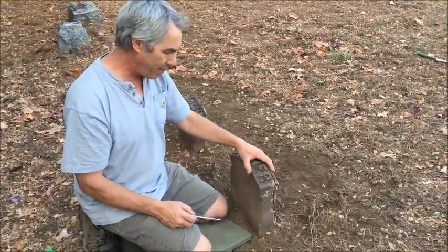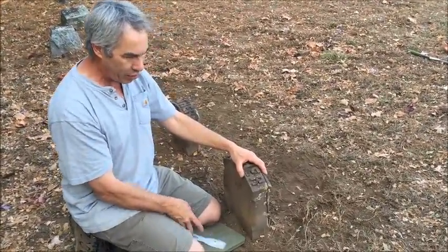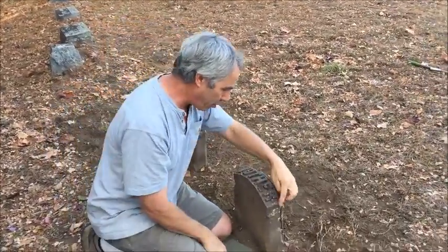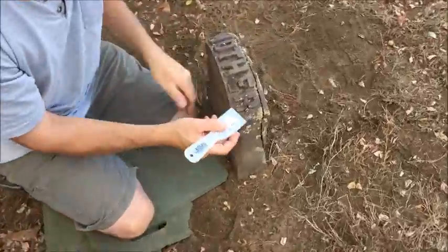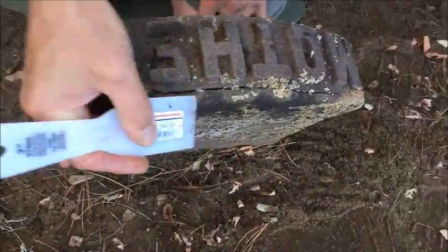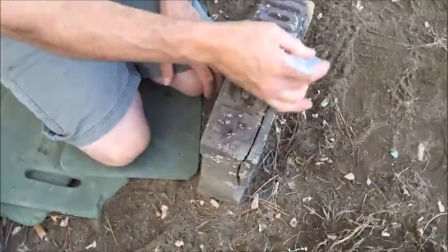What we have here is a delamination situation. It's like a piece of plywood that's left in the rain too long, or the way a deck of cards gets stacked together one card on another. When the stone is stood up this way — which is the most common way to historically make a gravestone — sometimes it wants to peel apart. If you come in here you can see the cracking, and what I'm going to do right now is clean this edge and get rid of a little of this biological activity.